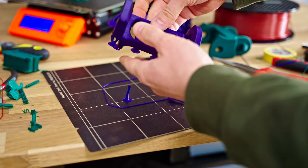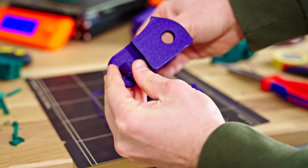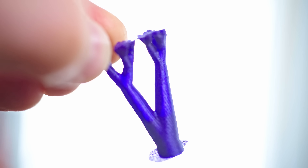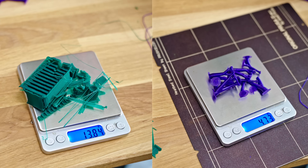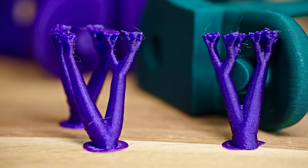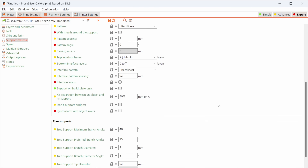Tree supports go outside the part if they can, but if they must, they'll still fall back to anchoring to the part itself. These branches are printed with limits on how steep they can be, so they still print reliably — they're just one wall thick, and you might be able to see they're translucent. So even though they're quite rigid, they weigh barely anything. Comparing PrusaSlicer 2.5 vs. 2.6, it's using almost two-thirds less filament for the support material. The branches widen towards the bottom so they don't fall over, and branch out towards the top so one column can support quite a bit of area. You can configure everything about these supports to your liking.